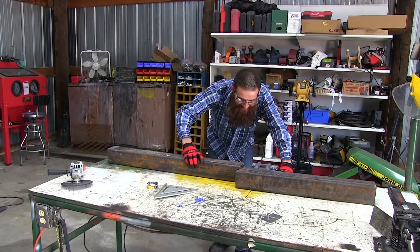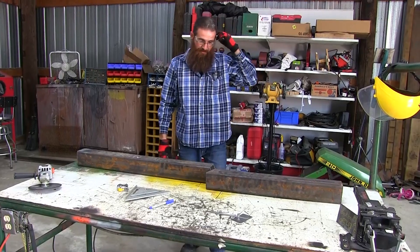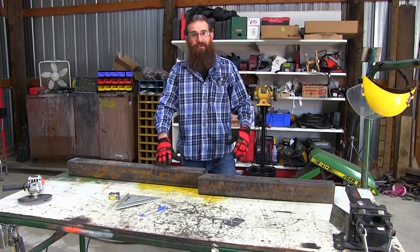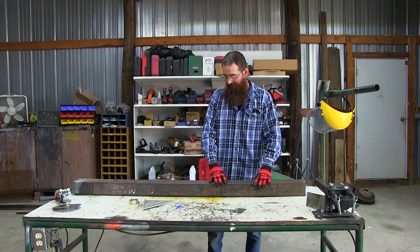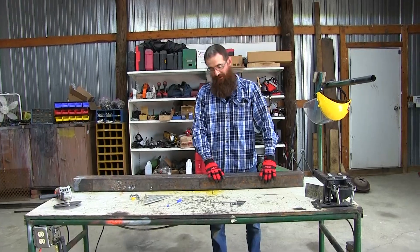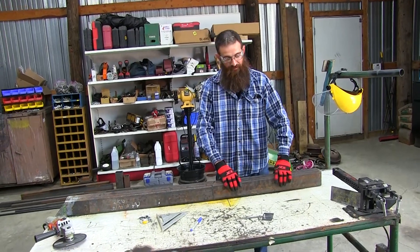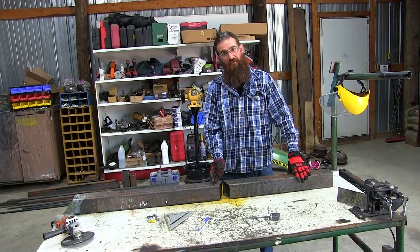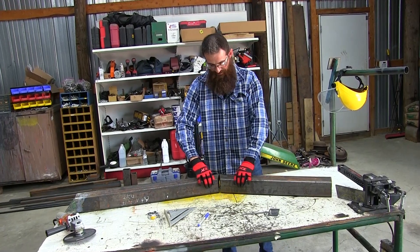There's some shenanigans, guys — I think we got some magic going on in here, I just can't wrap my mind on this one. We finally got this cut. Piece magically — I don't know how — but thank you, because this probably saved us some time. Coming back to what I was explaining earlier about cutting one 70-degree angle to get the two 70 degrees that we needed: basically when I take this one piece, flip it, and put the two points together, I get 70 degrees this way and 70 degrees this way.